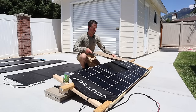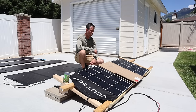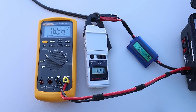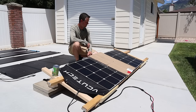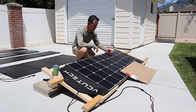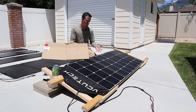Let's go ahead and partially shade the VCU Tech. I'm putting a piece of cardboard in the middle panel to see if we get two-thirds of the power or lose it all. On the VCU Tech partial shading, voltage is 16.56, but the current is almost 0.02 amps, leading to about 0.3 watts. That really cut the power down. This appears to be the first panel we've tested that's wired in series. We did some tests — putting shade in different positions got us about 25 watts or 60 watts, but be aware: if this panel has significant shade on it, you will lose pretty much all the power it puts out.